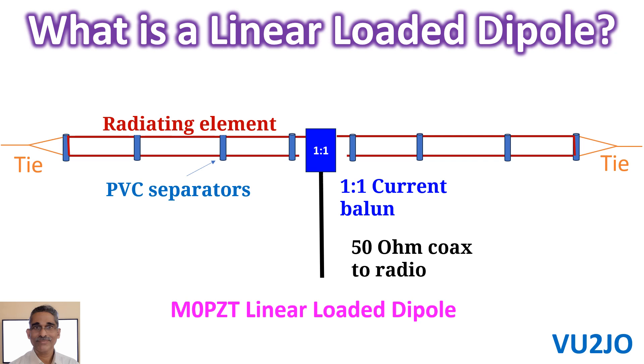More interesting for me is the suggested 80m antenna at 27.8m length, which I may try when solar cycle 25 starts coming down and the higher bands go down. But I will need zigzag mounting for 27.8m length, as I am just able to squeeze in my 20m long inverted V 40m antenna here.